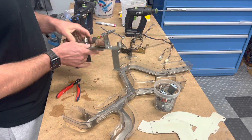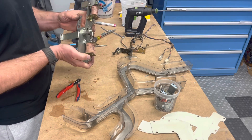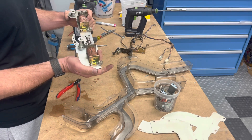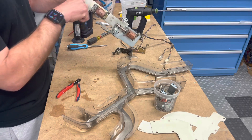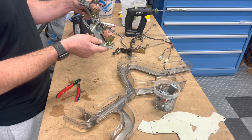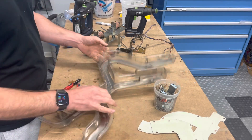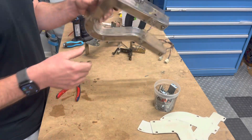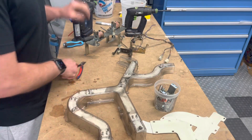I'm going to wash this also as an assembly and kind of go through it. I'll break it down further after I clean it, but I know I'm going to replace both coils and I want to get down in this diverter shaft with a wire brush and really clean that out. I want to do the same with that one too. I'm going to get the stainless steel floor out of here.